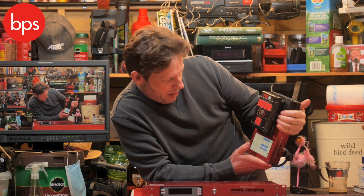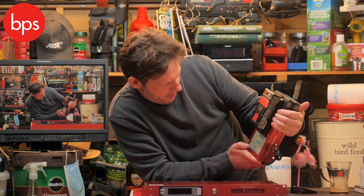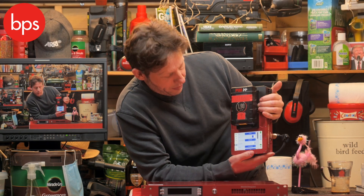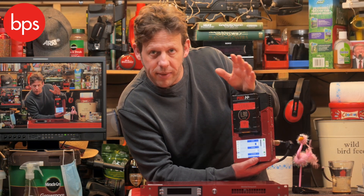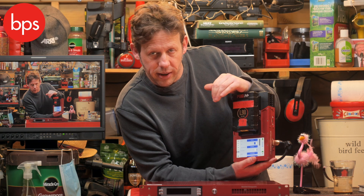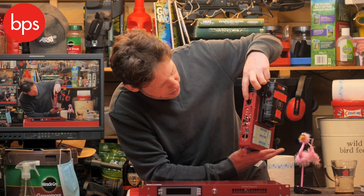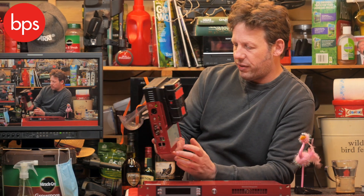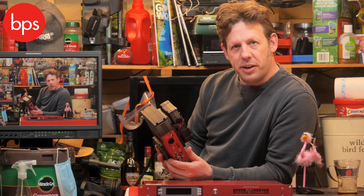Here we've got audio channels and bit rates. You've got local recording — currently disabled. You can have a tally so the unit is connected but not transmitting, allowing you to get your shot lined up and only transmit when you want to, which is actually very useful. You can also alter the data rate of your internal recording depending on what you need. You've got mains power here as well should you require it, and as you can see it's a very useful self-enclosed unit which really gives you options when you're out and about and need to send stuff back.